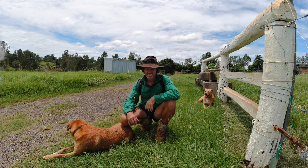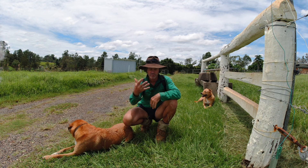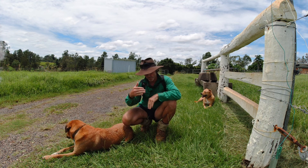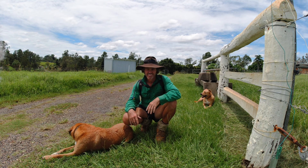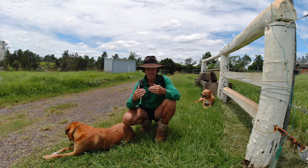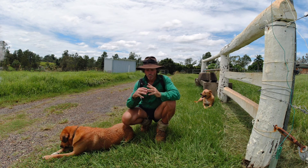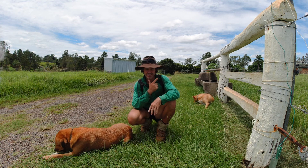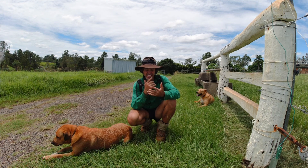What's important is to clean your vegetation off the fences. You need the lines to be as hot as possible to keep the cows in and get that psychological bonus when they get zapped — that it hurts — to stop them pushing the boundaries. If it's below two kilovolts it's not going to make much of a difference; you need to psychologically let them know that it hurts.